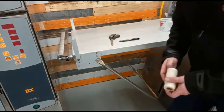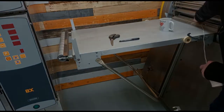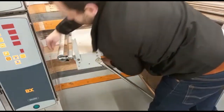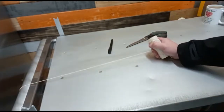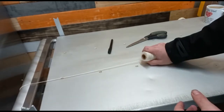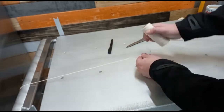Take your string. We're going to drop the string between the main roller and the drive roller, put it up underneath, take it around the idle roller. Once your string is around the drive roller and the idle roller, do make sure underneath the table there are no obstructions causing the string to push out further. We actually did this the other day and, whilst giving this advice, failed to do that ourselves and our belt turned out to be an inch or so longer than it needed to be. Not the end of the world, but it will shorten up the lifespan of your belt.